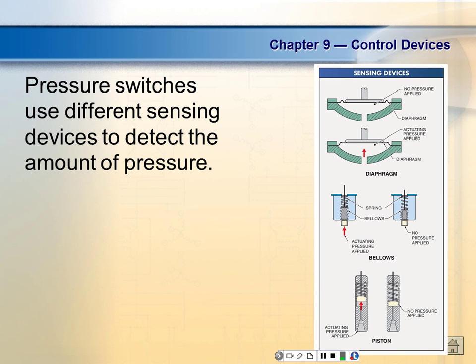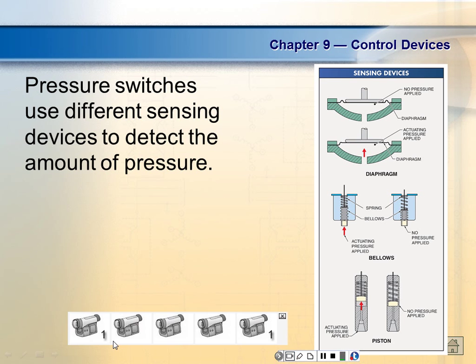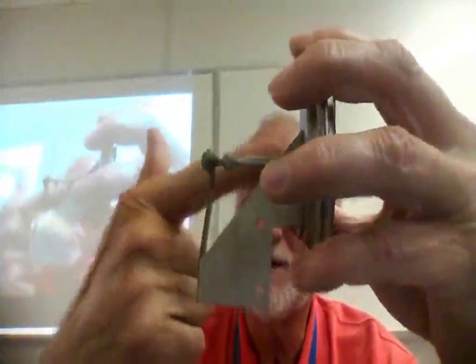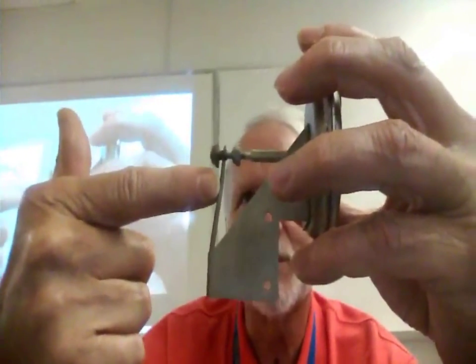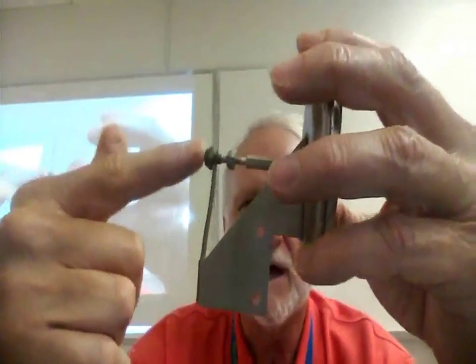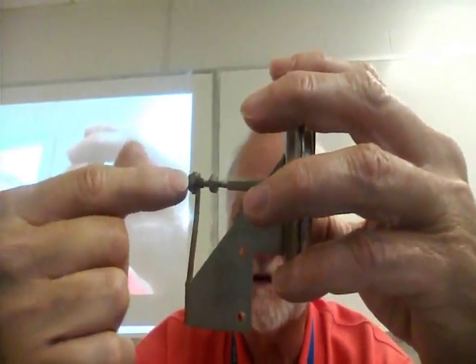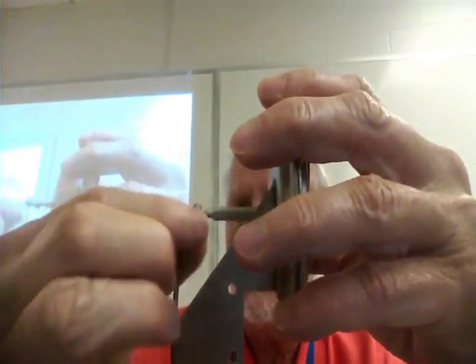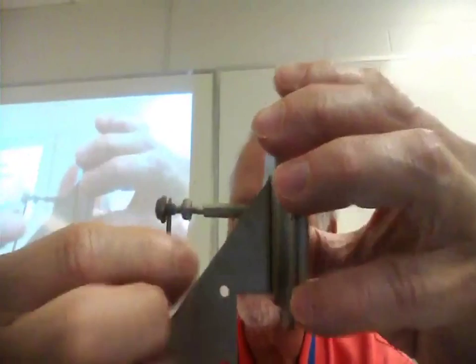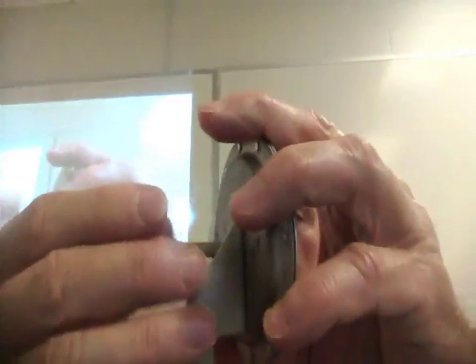This diaphragm type is spring-loaded with a plate inside. Sensors used in motor controls are actually a combination: something that senses pressure and a tiny limit switch that opens and closes when we reach a certain pressure. A lot of our sensors allow us to set the trigger point. Here you can see a mechanical adjustment with two set screws to adjust how far it moves. This is what we call a diaphragm pressure switch — very simple.